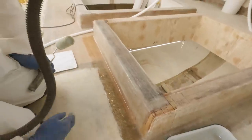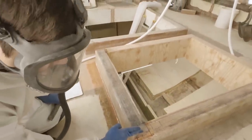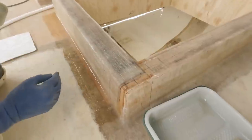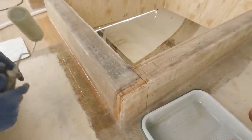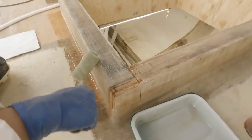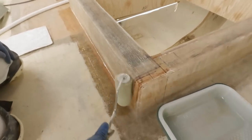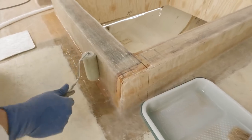And also on my other pieces here, I taper it back like this. Start out here, tapering it back in like that on the pieces that are going on here. It's good to get as much overlap on your layers as you can. That just transfers all the strength between layers.